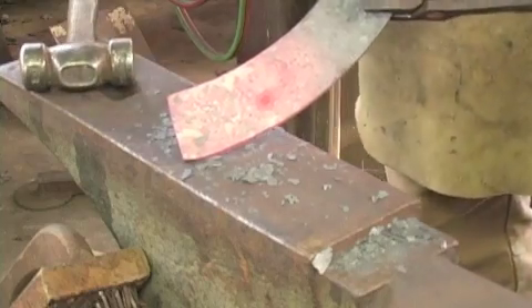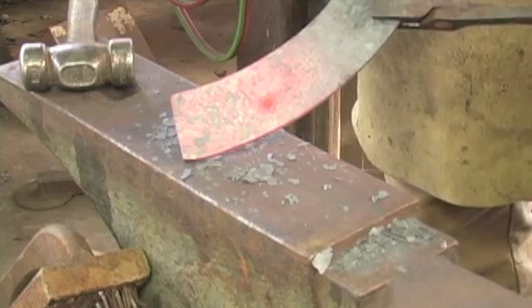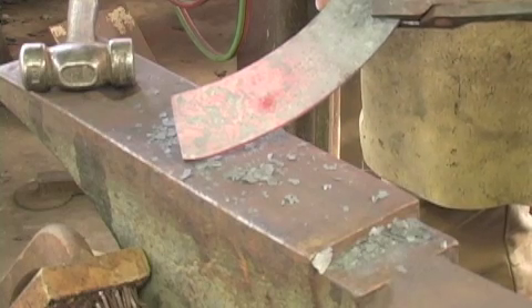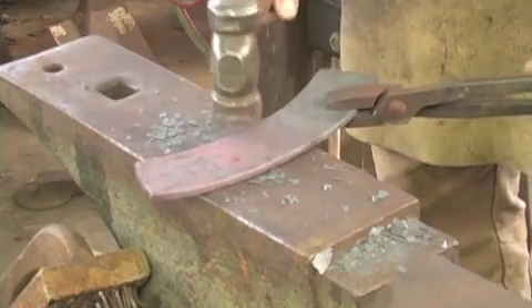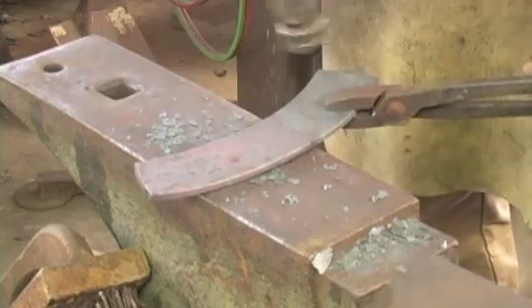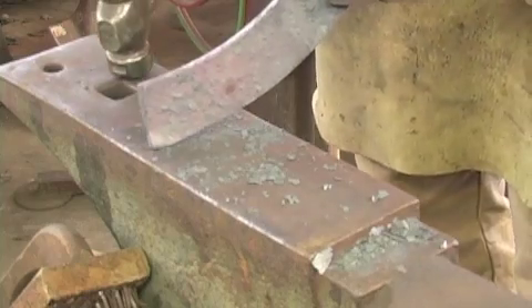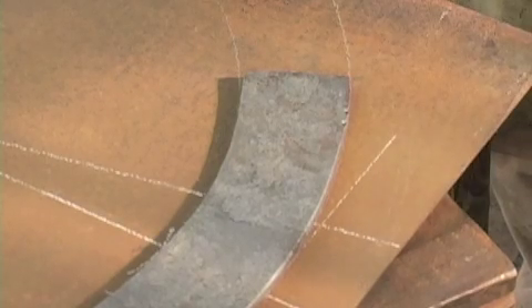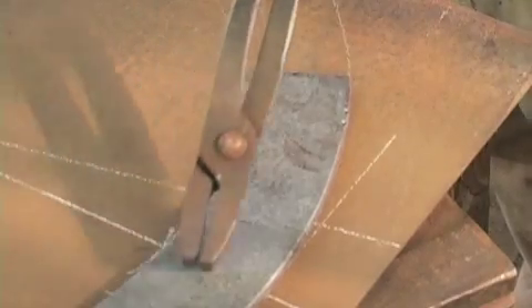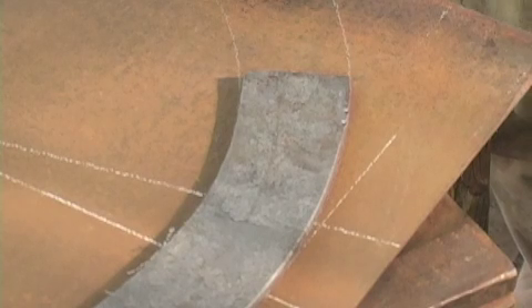I'm going to check this now against the drawing. We know that by making a ring, the inside dimension has been compressed and therefore is thicker, and the outside dimension has been stretched and therefore is thinner. If I bent it too far, I can come in and claim some of that excess thickness and spread the ring out and open it. If I haven't bent it enough, it's a simple procedure to just bend it a little further. Here is our initial drawing — checking our piece against it, that's fairly good, within parameters for me. My next job is to dish the inside of this ring, or cone as it will be, and make it slightly convex. That way when I roll it up I won't have a concave face to the outer surface — dish it convex, roll it up, and it will be flat instead of concave.